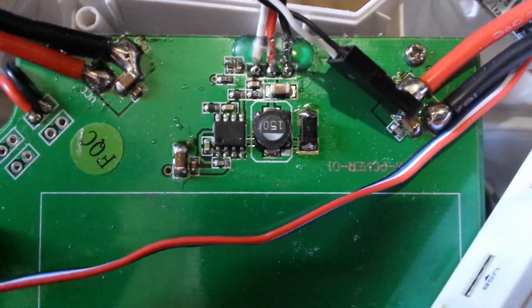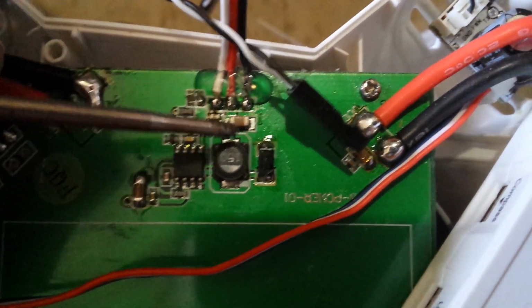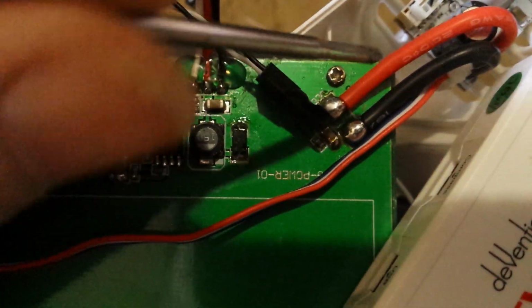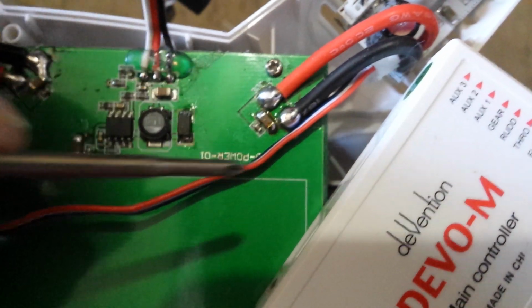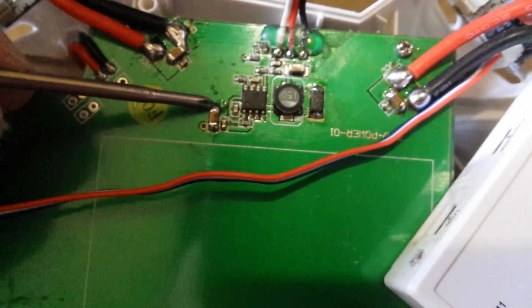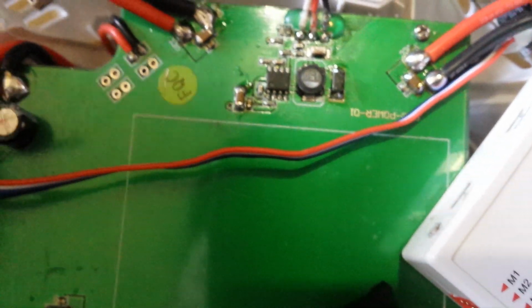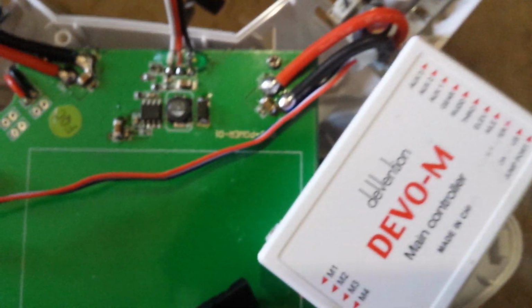So I solder that capacitor. If you look at this capacitor right here, you'll notice it's stock. I solder it too. I also solder this diode because the factory, when they solder these, they don't do it by hand. They place all these parts on a jig, and the jig holds them down on these surfaces, and then they put a small little dot of solder with flux on each side of these contacts, and then they put this in a baking oven and bake those connections on, and it doesn't make a very good connection. It has to be cleaned up and has to have a lot more solder built on it for whenever that connection starts to break down.